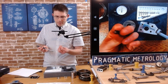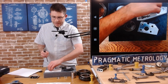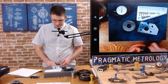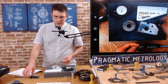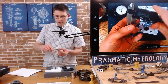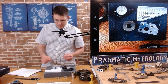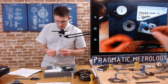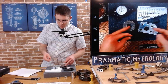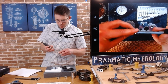So now I go back to the one that I used before that was too small. And we're going to add this spacer. This is a 40 thousandths spacer. We'll verify that with a caliper. 38 thousandths on a caliper, but again, 40 thousandths, the caliper may not be accurate. So, and in the end, it doesn't matter. We're going to zero on the gauge. We're going to zero on the ring. So we're just setting this up kind of remotely, loosely.